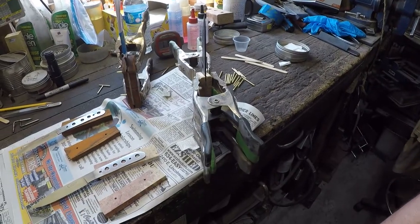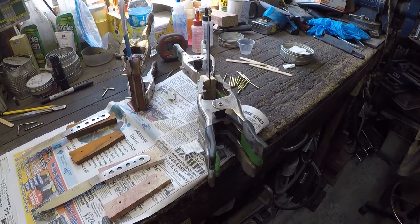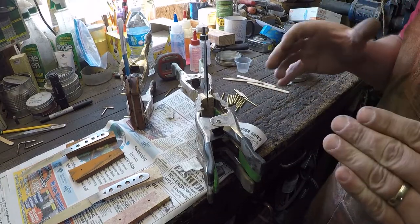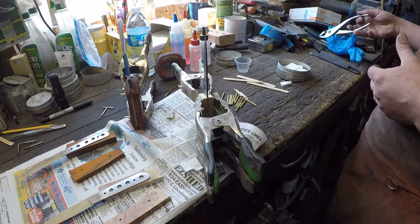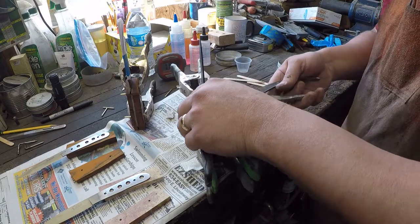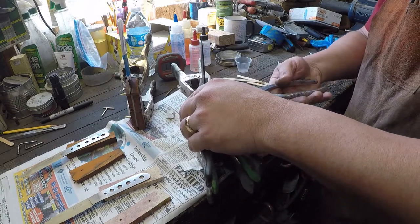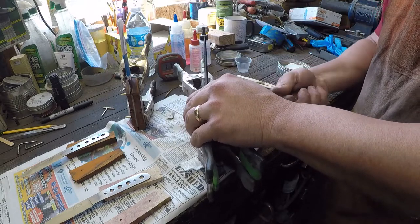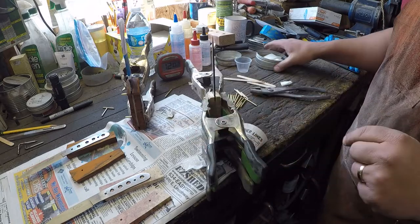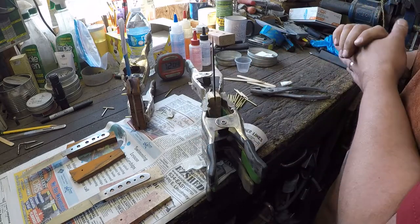It's past that 5 minute mark. Actually, we're at 11.4 now. So it's set up, but it's not completely cured. Remember that, it's going to set, but it's not going to be cured for however many hours of the next day. So you're going to grab your pins with a pair of pliers, and you can twist them and see if they'll pull out. Now this, we missed our window there.